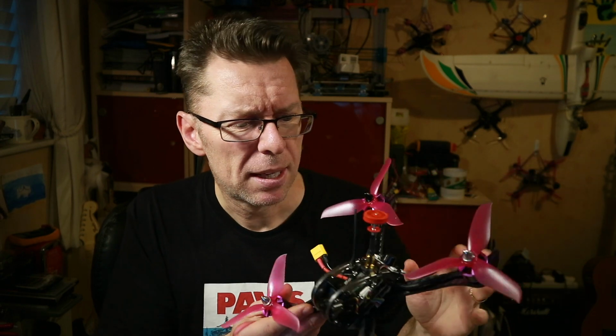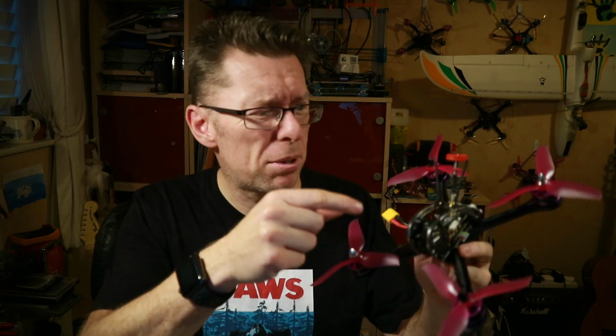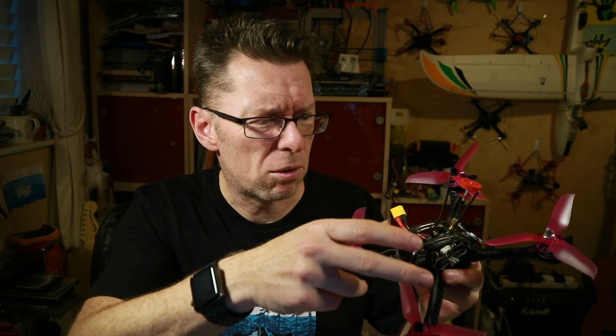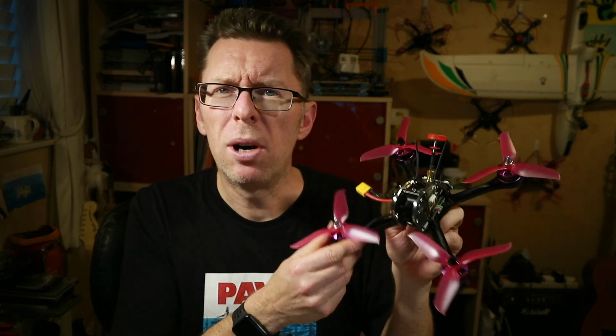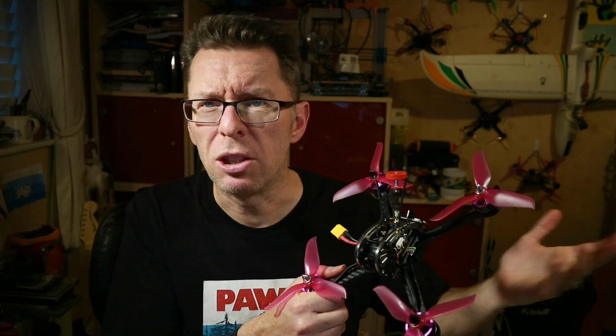So I've had to go to real nitpicks to try and find things that I didn't like about it. And there's only a couple really. Firstly, FrSky XM Plus, love the receiver. Haven't given me much hassles apart from 2 recently I've just got that seemed wrong. But if you're going to put an XM Plus in there and go to the hassle of wiring in, then for God's sakes, why not flash the RSSI version of the software and have that in the OSD? It just adds a little bit more that you can see and get a bit more information from it. That would have been nice.